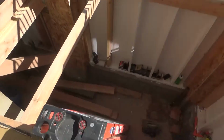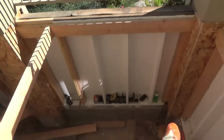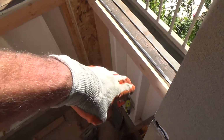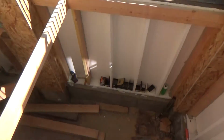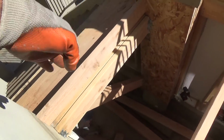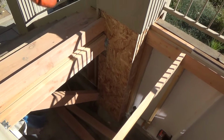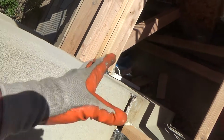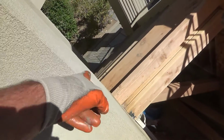Anywhere, because when this sheet goes down here, I think I want to start from this end and go this way. 8 foot is going to be about 5 or 6 inches away from this last piece. I don't want an extra floor joist 4 or 5 inches away from there, because we're going to be trampling back and forth through here. There's going to be more weight there. I've got to attach this to the stucco, and I'd rather have it attached over this way on this side, if that makes sense. So my sheet is going to start from there.